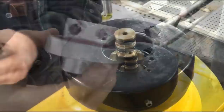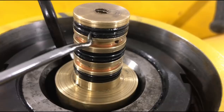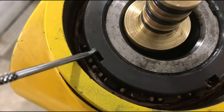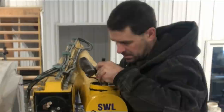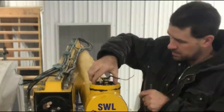They've sent the hydraulics up through this tube, which allows the hydraulics to be completely centered so it can rotate 360 degrees around. This boom is attached by actual bearings on that tube, and what I'm going to do is remove the nut that holds the bearings tight together. It has a set key washer underneath, which is a good idea. I just have to remove the tabs to take that nut off, then remove the top bearing so we can pull the boom up and off the bottom bearing.